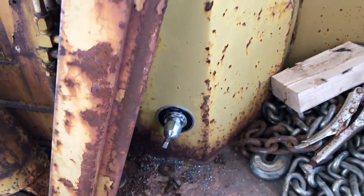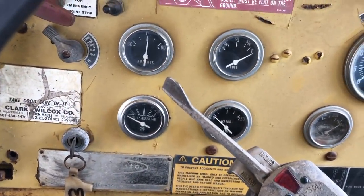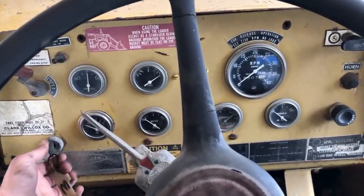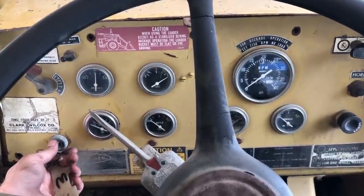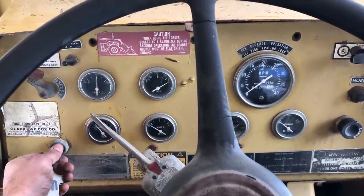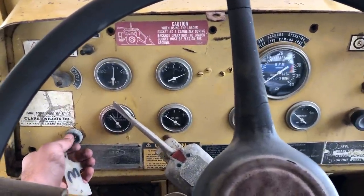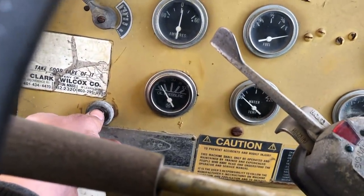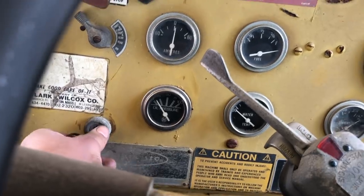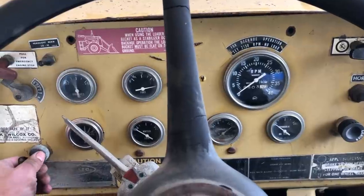Turning the batteries on. So with the RPM gauge there, and then oil pressure — we're going to want to see that. Are we ready for this? It'll probably take a little bit of cranking since it needs to feed fuel into the cylinder head. The oil pressure gauge moves a little bit. It says I have about 12.5 psi of oil pressure. That's not right. Here we go.